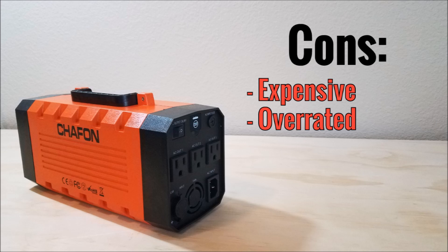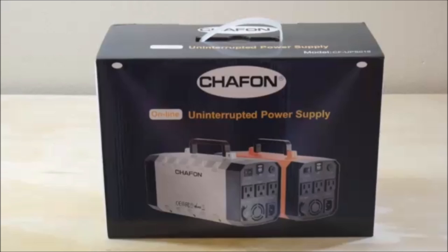But there are also some not so great things about this device. The biggest one to me is the price point — at $349 US, you can almost buy a 2000 watt inverter generator for that price. I also feel it is a little bit overrated on its capabilities; to get the true 346 watt hour rating you would have to only use a couple amps of power, which might be fine for recharging your cell phone or tablet, but there are a lot of cheaper devices for that. Overall, I would recommend this product to anyone who wants a silent indoor power solution that can easily be recharged with solar. Thanks for watching — if you're interested in purchasing this product, there's an Amazon link in the video description.